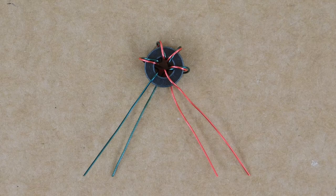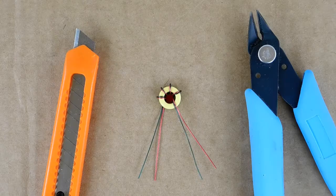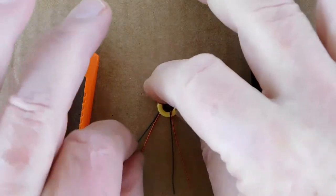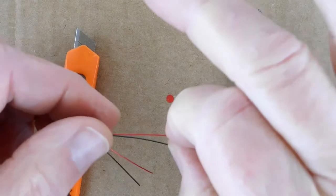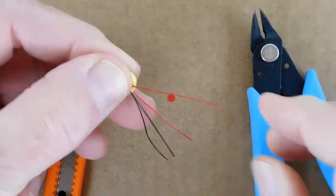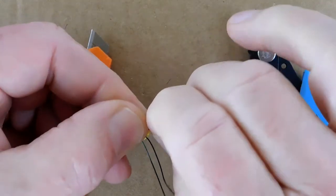As you can see, I had about an inch of wire left over after winding the transformers, and that's quite a bit more than is needed. However, if you're going to scrape the insulation from the wires, it's easier to do before you cut off that excess wire. I'm using a yellow toroid here, and that's not what should be used for T1 or T2. Black toroids should be used for T1 and T2, but I've already wound and installed those, so I'll just use a yellow toroid for this scraping demonstration.